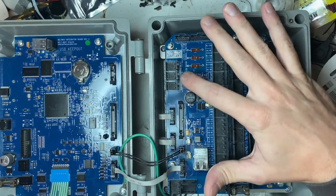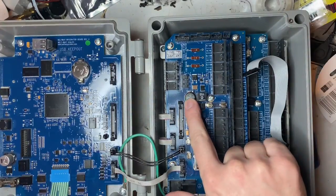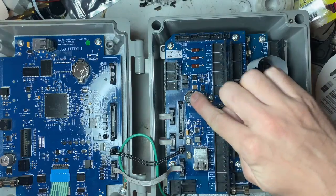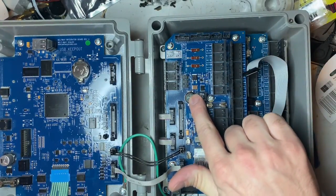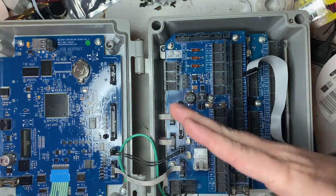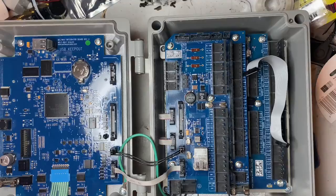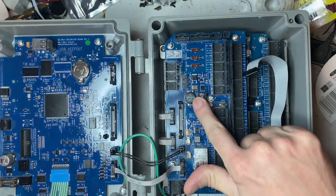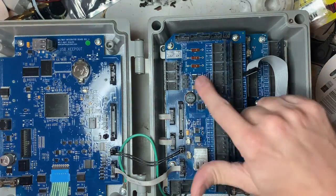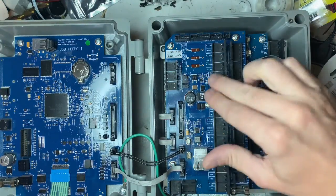This coil here — you can see how it's loose and wiggled — the pins of this coil are underneath, so it raises it up. The vibration of your machine causes this; eventually it will break off, and when that breaks off your buck boost will fly out and actually bind to the board, making it a real pain to change. That's why I'm telling you this now — put some hot glue or silicone in between here, bind these two together, and this won't ever fall off.